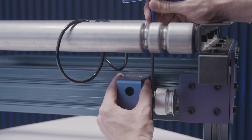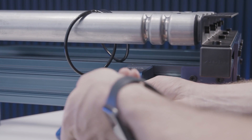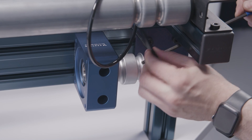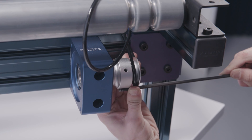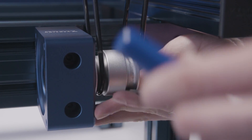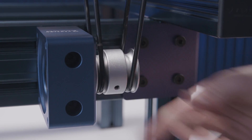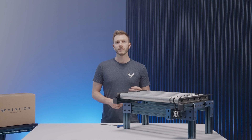Align the pulley with the grooves of the rollers above as best as possible before securing it in place. Once in place, connect the hanging o-rings. As a tip, you can use a T-handle as a lever to get the o-ring in place by first resting it in the desired channel of the motor mount and hooking the ring from underneath. Repeat this for each driven segment of your conveyor until you have it fully assembled.